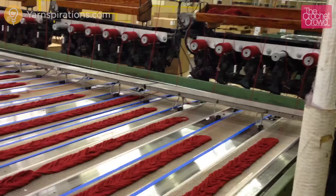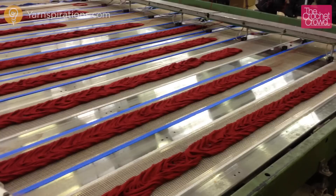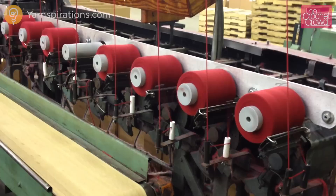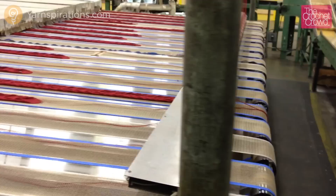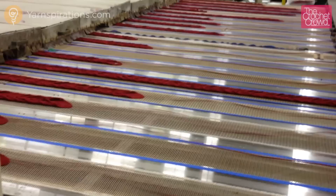The next machine dries the yarn before it's rolled into a yarn roll. Once through the dryer, the yarn is on a direct course to the final ball winding process. Due to yarn tensions, each conveyor moves separately to prevent the strands from moving too fast or too slow to the winder. The winders have a really wide diameter and the yarn is wound to the spool very tightly. The machine is timed to rotate a set number of times per cycle. Winding it tightly allows the process to give an accurate yardage and weight to the yarn ball. You can see that each conveyor is working independently. When the winding stops, the conveyor still moves forward to get ready for the next cycle and stops when the strands are detected at the end of the conveyor.